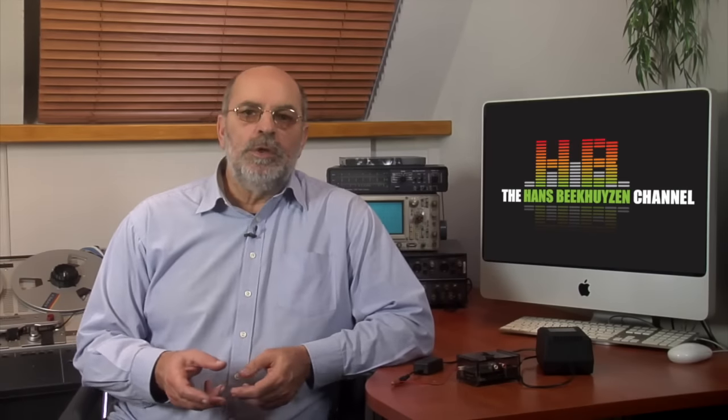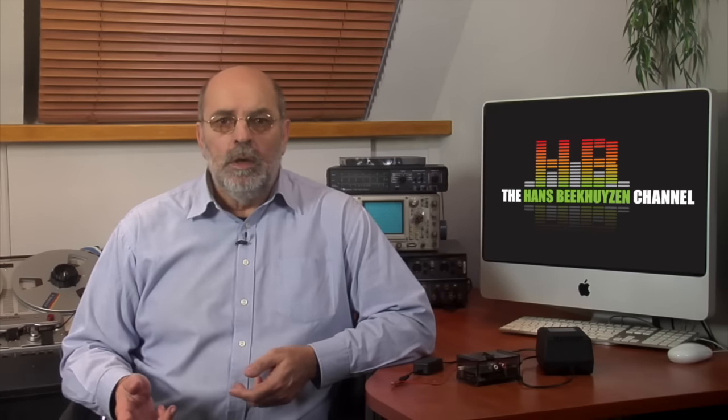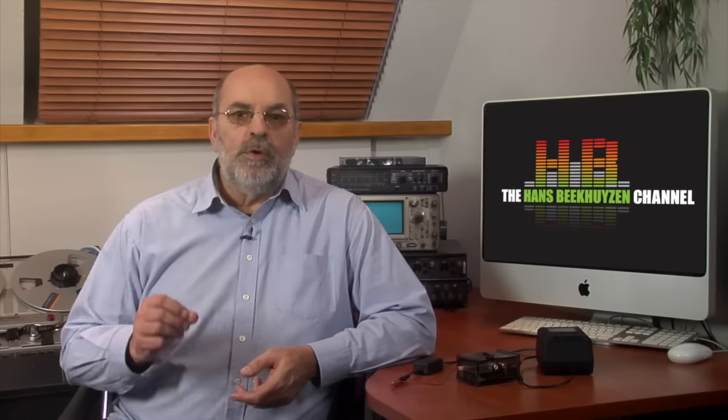When the DAC Pro board arrived, it was immediately mounted on the Raspberry Pi. I had bought a second Pi, and since the HiFiBerry boards come with everything you need, it's really easy. Mount four spacers on the Raspberry Pi board, plug the DAC board onto the expansion connector and over the spacers, and fix it with four nuts. That's all. The DAC Pro is powered from the Raspberry Pi, so you only have to connect the interconnects between the two RCAs and your amp.